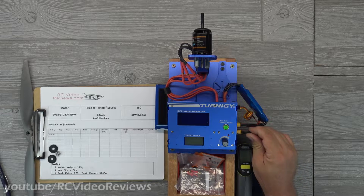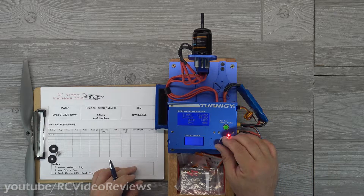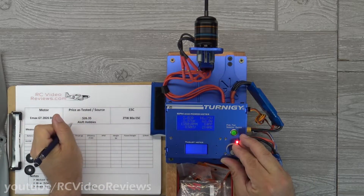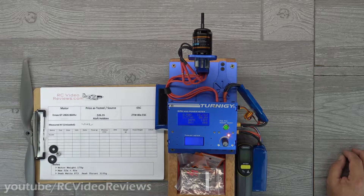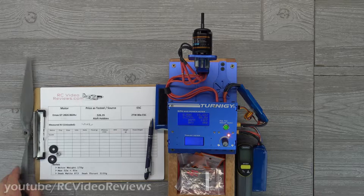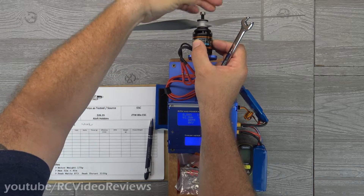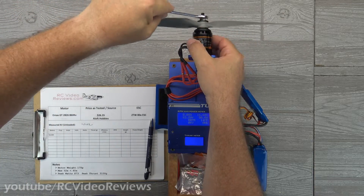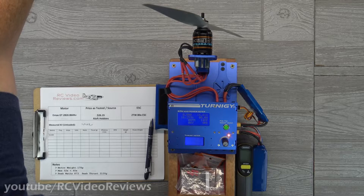I've got the Emax GT 2826 mounted up on the Judge and ready to spin. I'll plug a battery in and check the KV real quick, and also make sure it's spinning the right direction — and actually, this time it is. I ran it up and saw 994 kV; as I've mentioned in the past this stand reads about 100 kV high, so that fits for an 860 kV motor. Let's get the prop on and spin it. They also give you two washers, each with a smooth side and a side with teeth cut into it, which is really nice — when tightening the prop on a compression fitting, those teeth bite into the prop and help make sure the compression collet actually grabs the shaft.